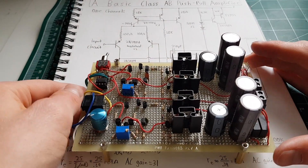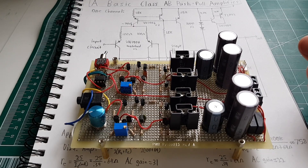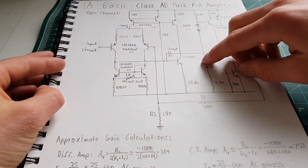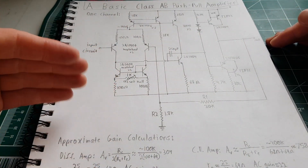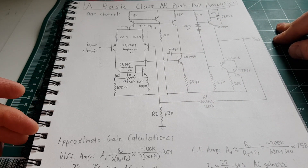This is a very crisp, clear-sounding amplifier. The wiring is a disaster and the power supply is kind of a disaster — it's very thrown together — but the sound is very crisp. I haven't measured the distortion yet, but it amplifies transients much better than the single-ended triode tube amp does. It's such a simple design: aside from this compensation capacitor there are really no caps in-line, so it's a very clear signal path and quick transients in the audio band get amplified fairly cleanly.